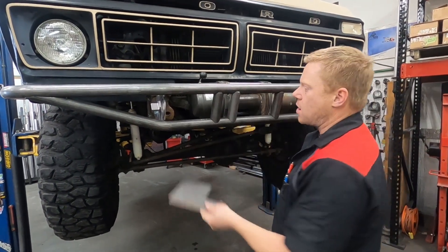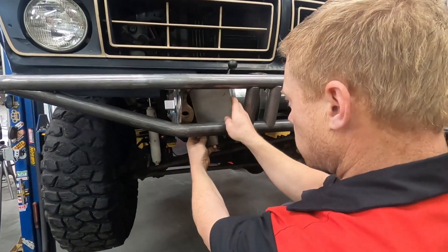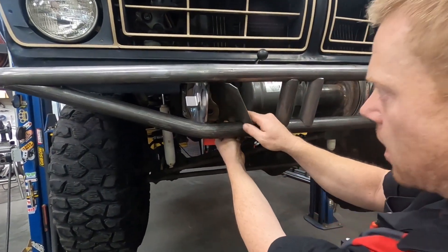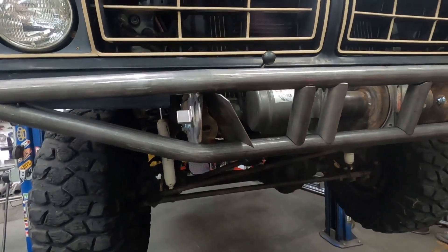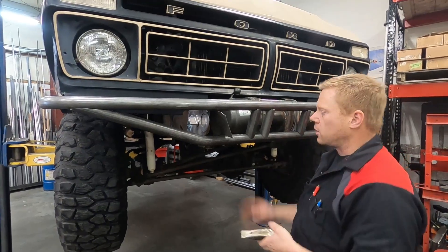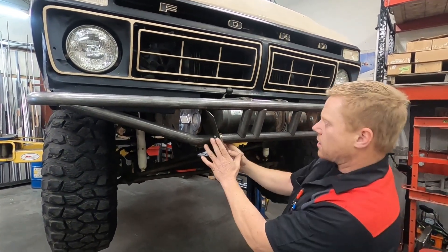This is just a piece of sheet metal I found that fits in here pretty well — positioned like that it's going to deflect these sparks down and out of the way. We can add a little clamp to make sure it stays in place, just like that.